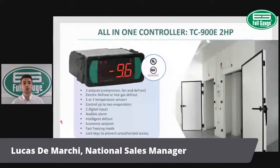The controller is also loaded with three layers of set point: normal operating set point, economy set point that will reduce compressor cycles during nighttime, for example, and the fast freezing set point that is used when you are storing products inside of the room and you want to quickly chill down the product temperatures.